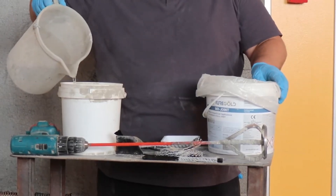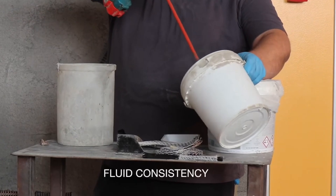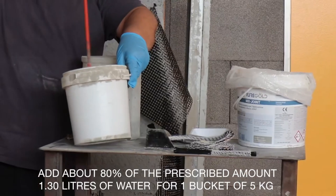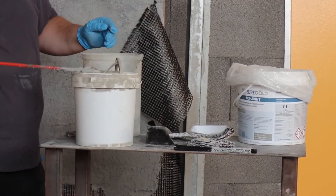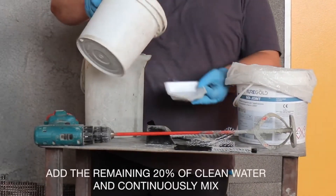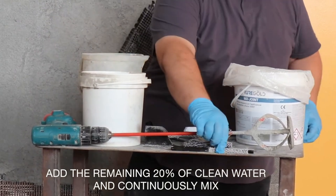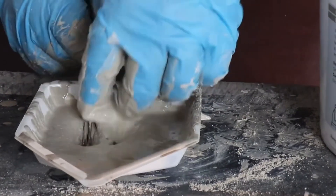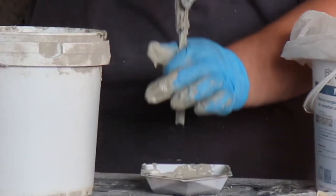This gives a total length of 25 centimeters or 10 inches. Then open the 5 kg bucket of MX joint and pour in 0.95 liters of the required total water content and mix for about 3 minutes. Use a paddle mixer drill at low speed, continuously mixing without stopping until a homogeneous mixture is achieved. Then add a further quantity of around 0.35 liters and continuously mix until the mixture has a fluid consistency. This should take about a couple of minutes. Then take the previously prepared carbon anchor, dip one end into the MX joint until fully impregnated, and leave to dry for about 24 hours.